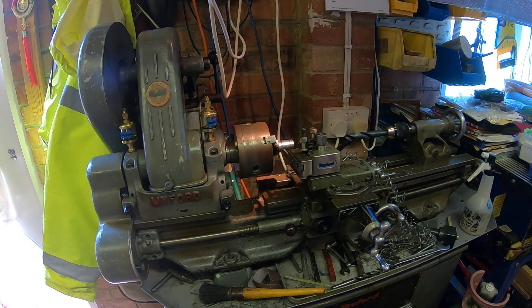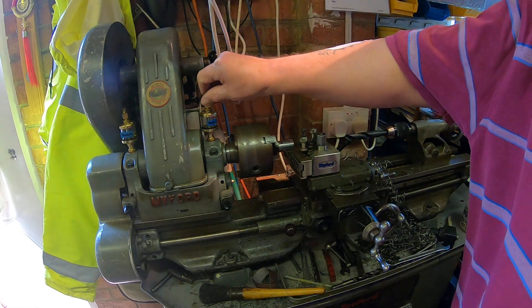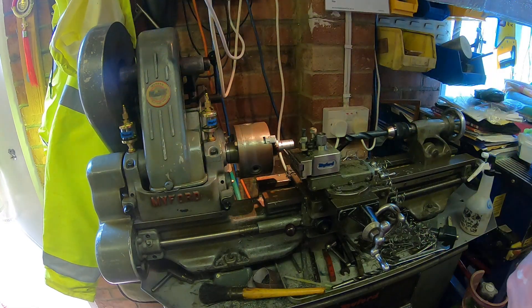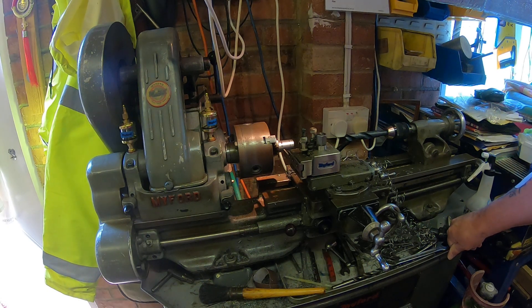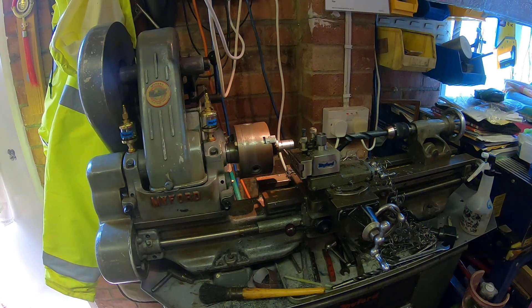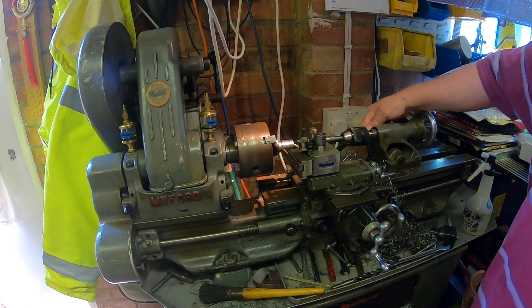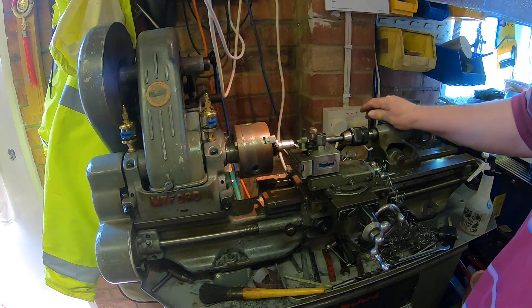Okay gentlemen, here's the setup on the lathe. I'm currently going to produce a couple of standoffs for the mower — the famous mower with no drive. My Myford lathe is set up with the oil drips. I've got this piece of scrap steel and turned it down to an OD that fits. I've gone in with a couple of drills, slowly increasing the ID, and now with the very final drill at 13.5mm. The lathe is set at the lowest speed and I'm just about to bring in the drill bit — a blacksmith drill bit, a pretty strong thing.